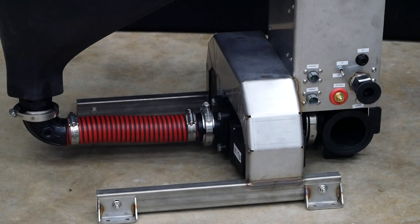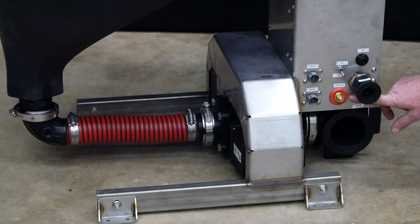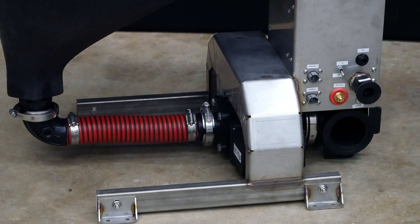Additional flow meters, valves, and our flow stack would plug into that port. There's a matching port on the other side so cabling can come out of both sides and go in both directions. We have electrical connectors at the bottom — the red one is for positive power coming into the system, and there is a bolt underneath the rinse connector for the negative power connection.